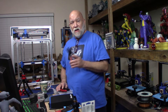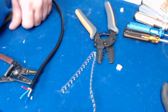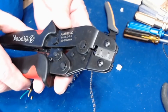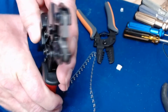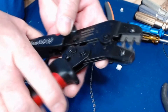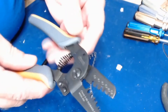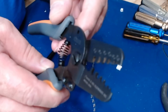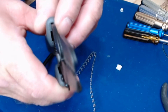I'd like to share with you what I learned and how I do it — maybe it'll help you out. Here are my two crimpers. The first one came with the set and is for DuPont connectors; as you can see the teeth are very wide and they ratchet down and hold in whatever position you want. The ones I reordered are a smaller set — very narrow — so I can get to a specific spot on the connector I want to crimp without crimping the whole thing at once.